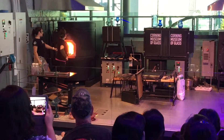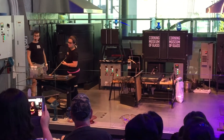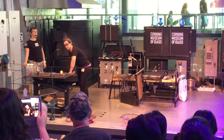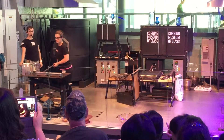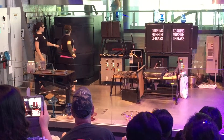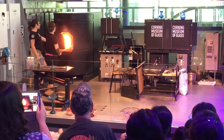Welcome to a live glassblowing demonstration. This is Jamie Perrion, your master glassblower, making a beautiful folded lip fluted bowl compote this evening. She's gotten started by gathering molten hot clear glass out of our gathering furnace, which holds about 250 pounds of glass at a temperature of 2,120 degrees Fahrenheit. It is clear glass, but it glows orange from the radiant heat coming off the material.